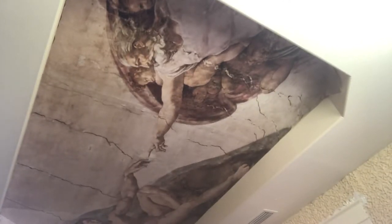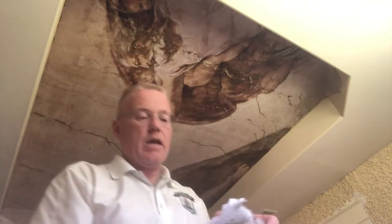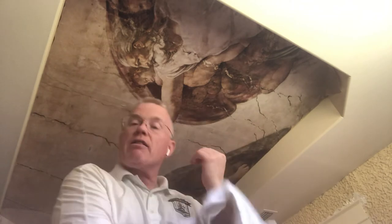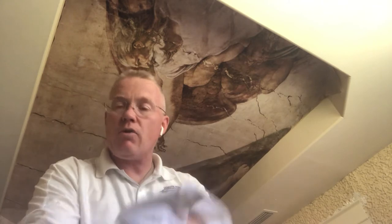Why do I put this on tape? To show off how much I know about wallpaper installation? No. I want to show you that the cleanup is done best with nearly dripping wet towels — they're nearly dripping wet. Why? You're diluting glue that's on the face of the wall covering. It's a long process, but you want to dilute the glue so that it becomes innocuous.